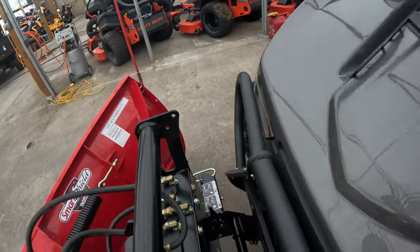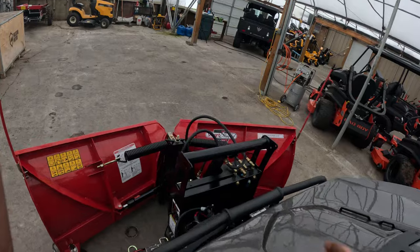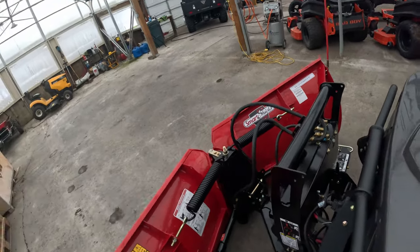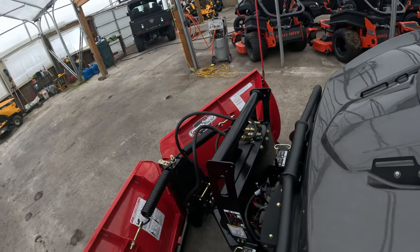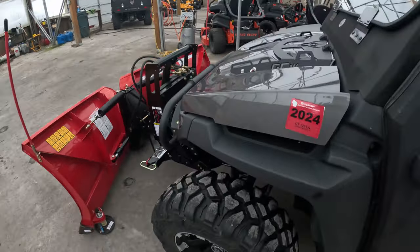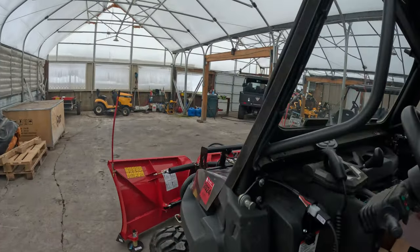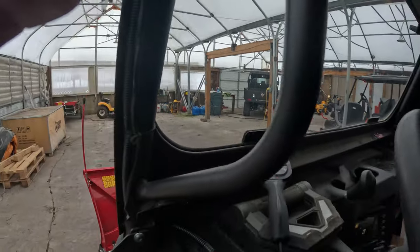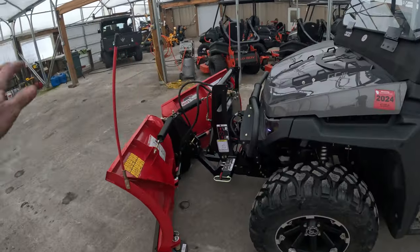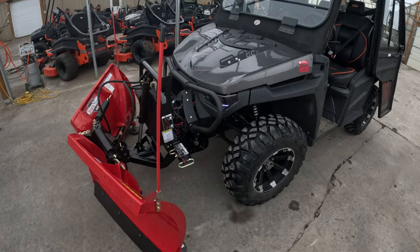The biggest struggle, like anything, is just getting it lined up. If you use the visual cues of the front of the machine with the bumper, you'll be able to get it close enough. It's heavy but not impossible to shimmy one way or another — get it close, get out, check your work, pull that up, locks in there, and you're set to go. That's a quick overview of the Boss V-plow mounted on an Intimidator UTV. If you have any questions, feel free to comment or reach out — thanks for watching.